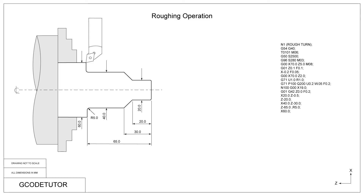That brings us to the end of our subroutine, using end number N200. As we spoke about on the G71 line with P100 Q200, the Q200 references this N200 — it can be any three-digit number. G40 turns off cutter compensation and the X value brings our tool away from the diameter of the job. I also rapid the tool five millimetres off the face of the job. I've programmed this move using a feed rate of 200mm per revolution under G01 — a very fast feed rate approaching rapid speed, but more controllable using the feed override switch. This move can also be done using a G00 rapid command.